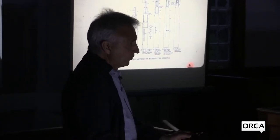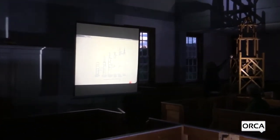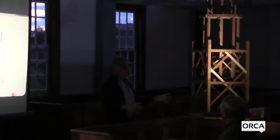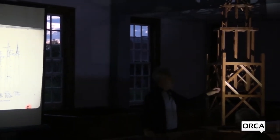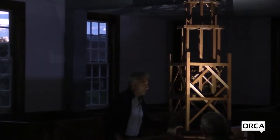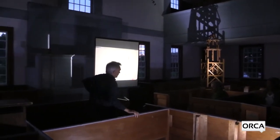But in both those churches, I found down at, if you can imagine, at around this level, thick planks across the corners. Just across the corners, on top of the planks, 1-inch boards, and in the 1-inch boards, 6-inch diameter circles cut out. Those are the bases of the gin poles, which you can stick up quite high, tie off to here, grab hold of this way down below, and just slowly bring it up. And the truth of the matter is, these wooden ones, they're not really heavy.